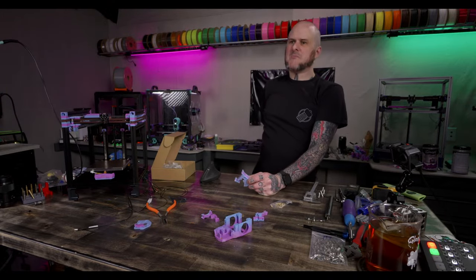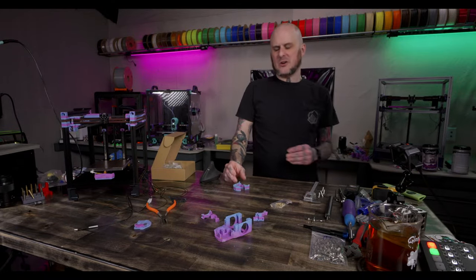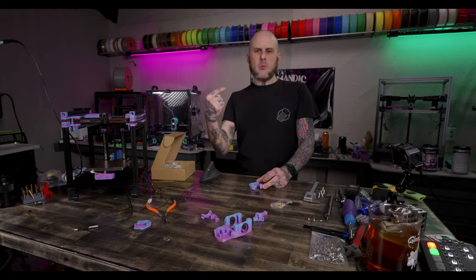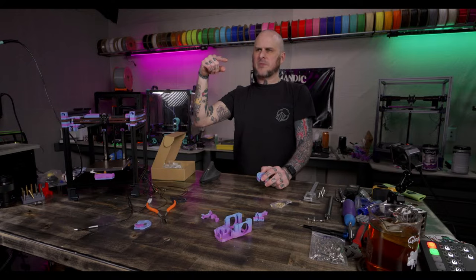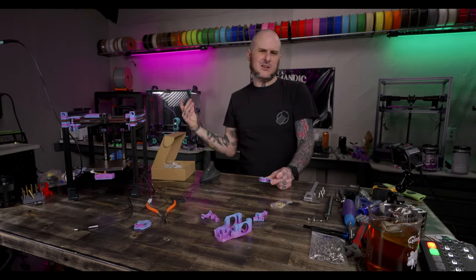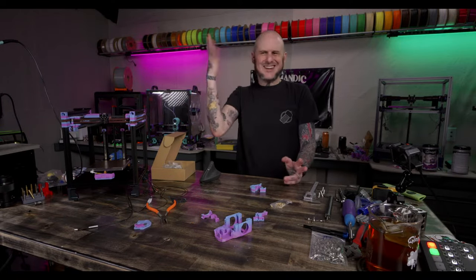It would satisfy my OCD if the chamber thermistor was in the middle. Yeah, but then it would be behind the lead screw, and it's also where the wiring runs. You have to think about where that thermistor is, because it sticks straight out of the back of the panel. So it's gotta be placed in a logical spot. If the entire wiring harness for the tool head has to go past it, not ideal.